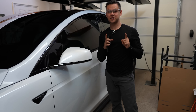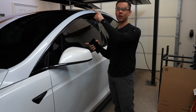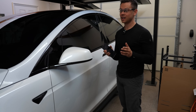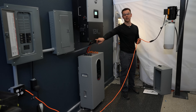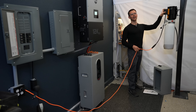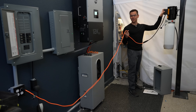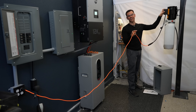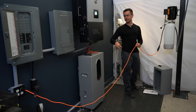The 18K can charge a Tesla at 32 amps and run the car lift simultaneously — the car lift is only on a single leg, making it a very strenuous test. Let's see if the 12K can do it; this is also the best way to test the line balancing function. No way — holy cow! An 8,000-watt inverter running near max capacity can also run the car lift. The surge capacity is supposed to be better than the 18K and I don't think they're joking. It also has a tough time when the car is already lifted, which is even harder than most of my usual testing.